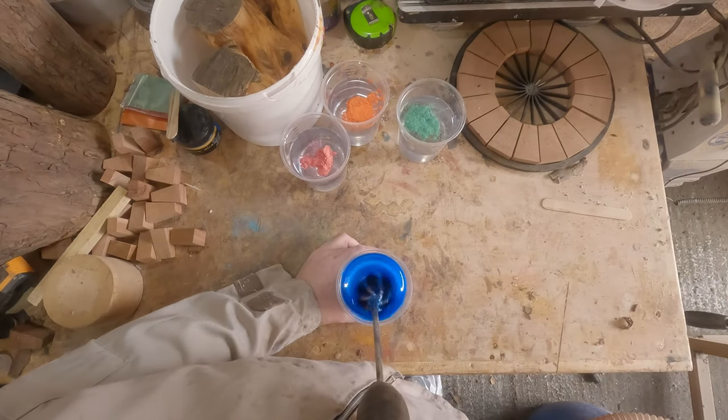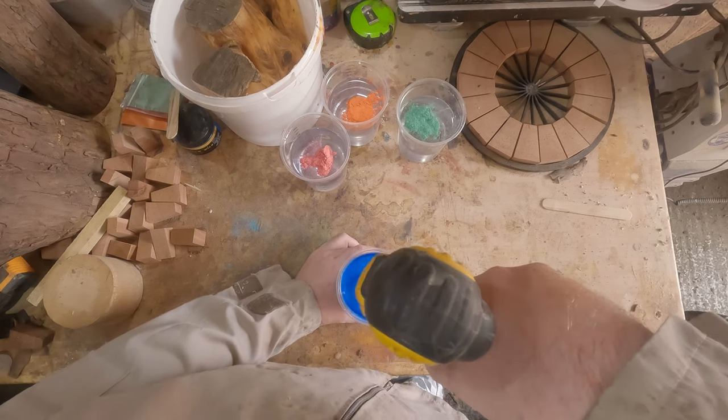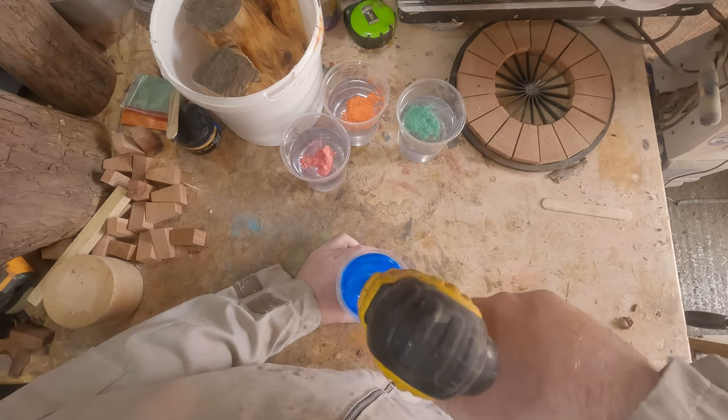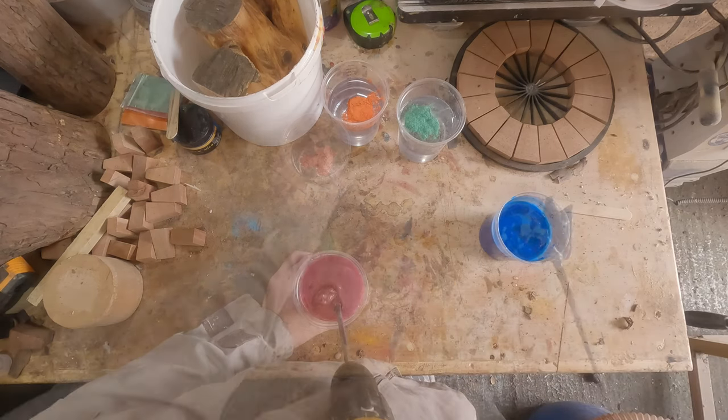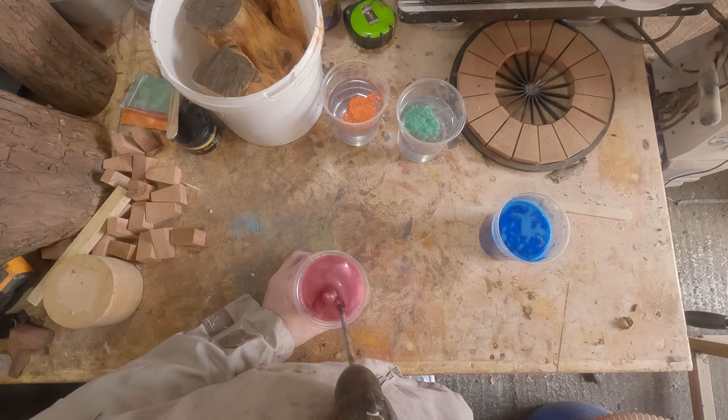The T-Expert resin is thoroughly mixed at a 1-to-1 ratio, then left to pre-cure. I mixed an additional batch without any colourant. I use this to prime the surface of the yew. I hope this would reduce the voids that I've had to deal with on other projects.